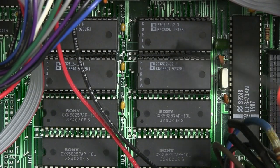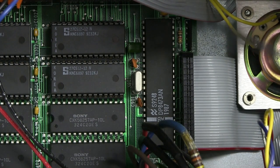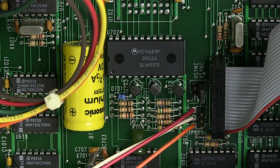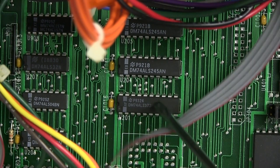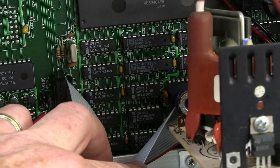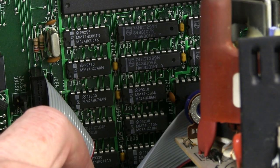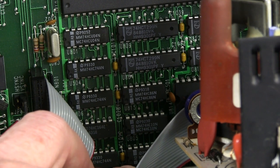Looks like we've got some socketed mask ROMs up here — 27C512, 512 Kbit, so 64 kilobytes each, 256K total ROM in this thing. Got ourselves a National Semiconductor DP8473 — that's just a floppy disc controller going off via ribbon cable to the floppy drive. Next to our battery, no surprises: it's a Motorola MC146818 real-time clock chip — old school. I've found some chips as old as the 24th week of 1993, so this dates the thing at just under 20 years old. All that logic under the main CRT controller is 74HC logic — that's obviously the dot shifter and stuff, implementing it using discrete logic.